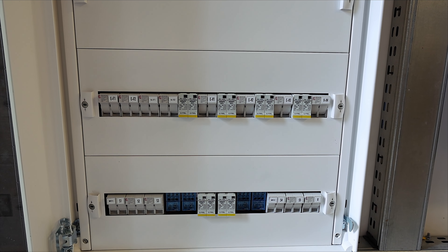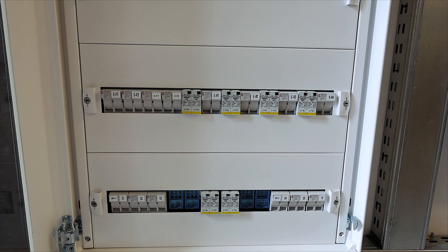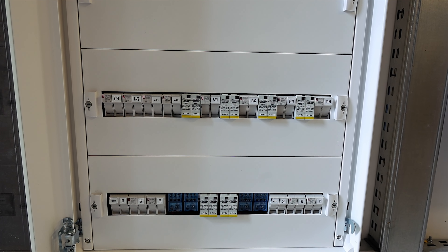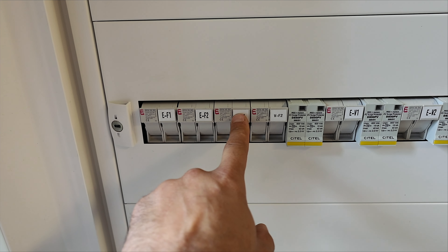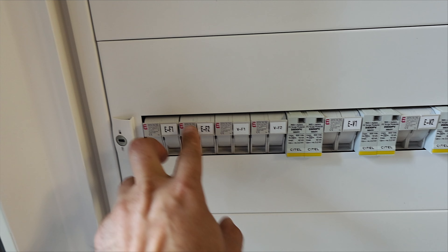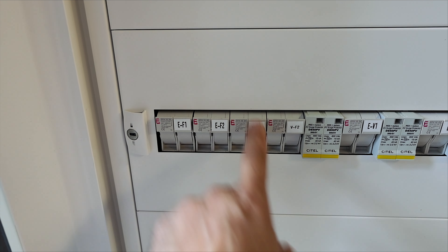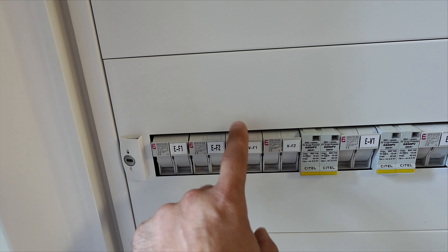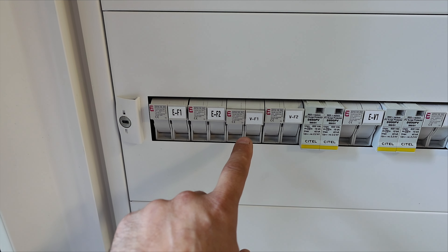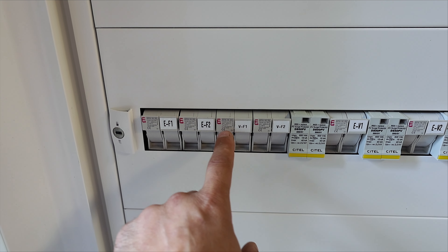As you can see, I have separate strings for east, west, and south because my house has three orientations. I decided to install solar modules on each of them — around 44 kW of solar modules from Trina Solar. For east and west I decided to use Fronius inverters, with two strings connected in parallel inside the inverter, so the Fronius handles around 24 kW of Trina solar modules.